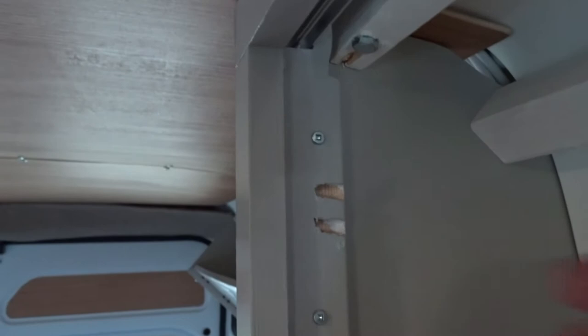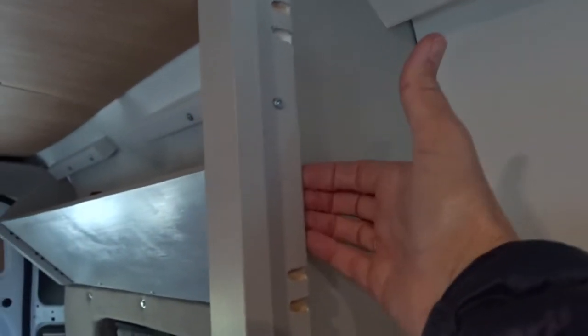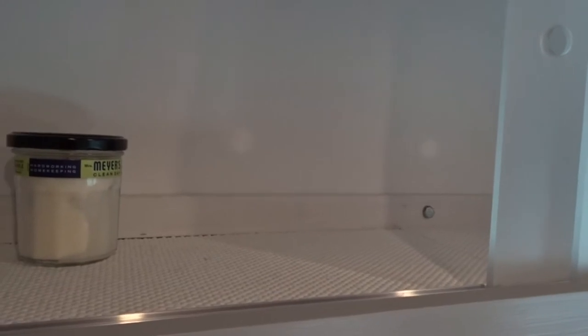This whole frame right here is attached to give it additional stability with this piece going into it. It's like a jigsaw puzzle — these three pieces are holding on this piece, this is screwed into this piece, this is screwed into this piece. It sounds sort of crazy, but as long as you've got a good foundation it is solid, solid, solid as can be. I put 1¼-inch plywood under here because the cans are pretty heavy and I wanted to give it some strength.